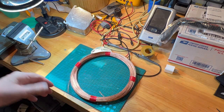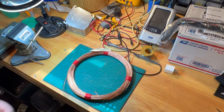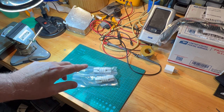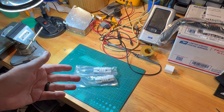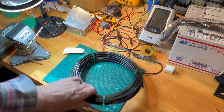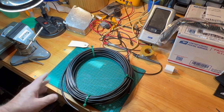Antenna wire. I know a lot of people would prefer to have a jacket over it, but I just went online and bought this. I used bare wire in the past with dipoles I built many years ago, and they served me well, so I'm really not too worried about that. Egg insulators — you need one of these on each end of the dipole. A little roll of antenna rope to hold the antenna up in the air. And finally, a hunk of coax to get it into the shack. I believe this should be long enough. I'll put the connectors on it and then we'll run the antenna up and see how it looks.